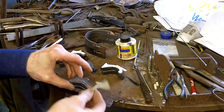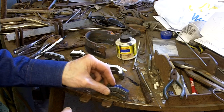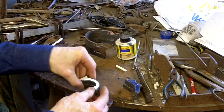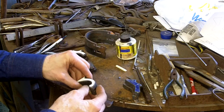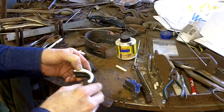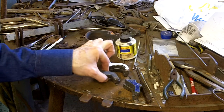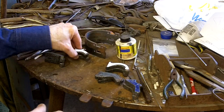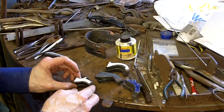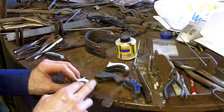There's the number four style — that's a tin pattern. Takes a little longer to profile a pair of those because there's a little nub there, a little shaft guard. On the gooseneck shanks here, it takes a little extra effort to get those shaped up — you'll spend a little extra time over what a pair of cutter shanks take. And then this lady's shank here that I'm building — a custom pair of spurs that has a shaft guard — it takes a little extra time to kind of get that cleaned up.